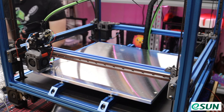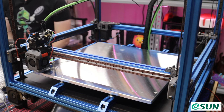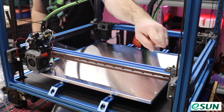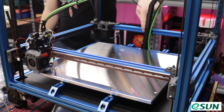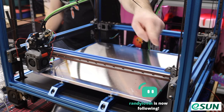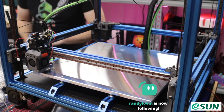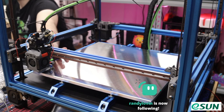With this probe orientation, I can't get the full X or Y travel. I've taken the part that typically goes here to stop the chain and mounted it to act as the end stop, giving me a 20 millimeter buffer for the extra wiring coming out the back of the extrusion.